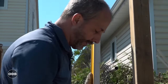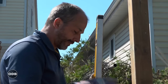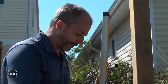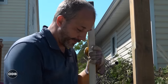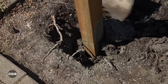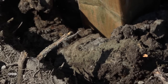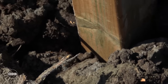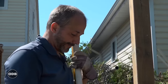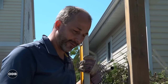To recap: we're going to set this post right where we want it, perfectly level, and leave it alone. You don't even need to brace it — this is how brilliant the cement is, it starts setting so fast. If you want to brace it you could, but you might just upset things as they're settling. We're leaving the top couple of feet, putting clay back in that hole and pounding it down with a tamper. That way when the ground starts to freeze it'll act like a frozen lid, keeping the base from ever being pulled up out of the ground.